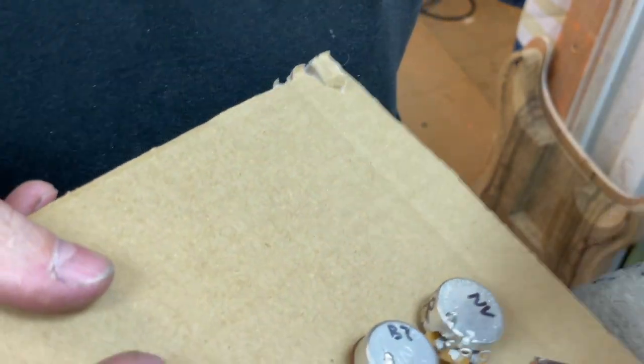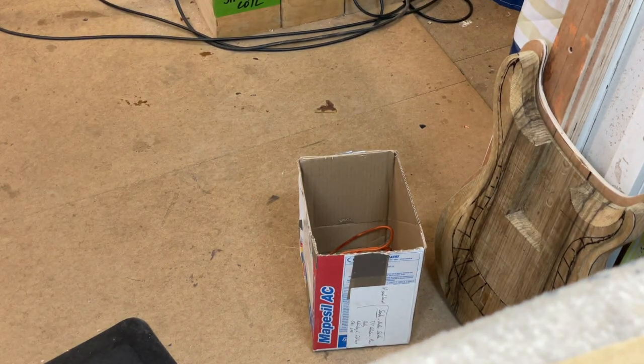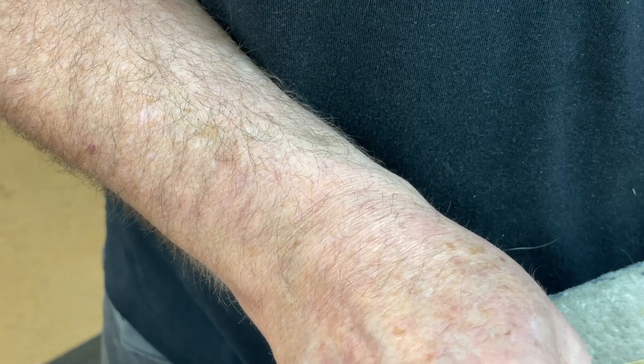Okay, so my two volumes, one of which is a push-pull, are done. Well done there. They're grounded in the ground lug. Right, hurrah. Now we're going to need some wire that joins them all up, and I'm going to use a piece of braided wire and use the inside bit for that, so we can have fairly stiff wire. So we're going to join four of these up.